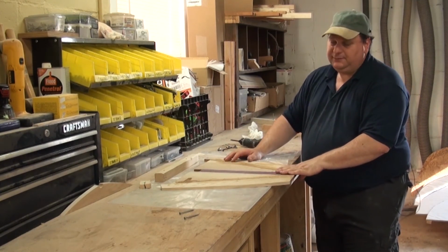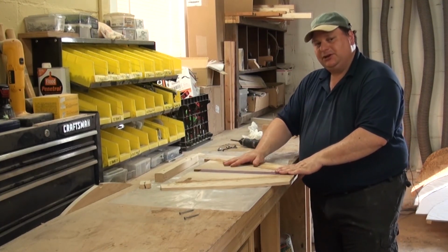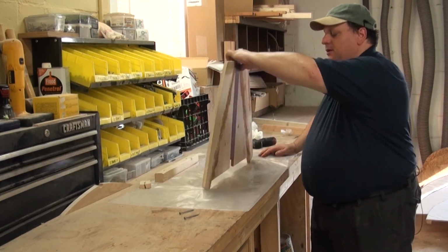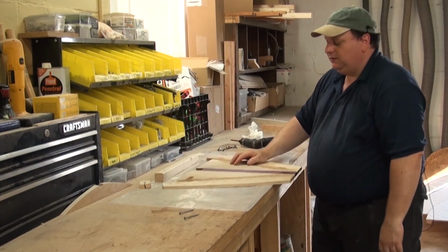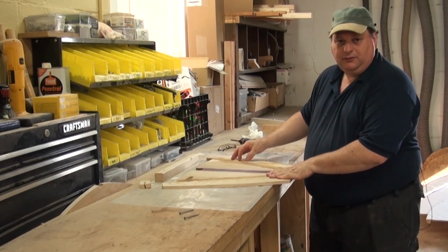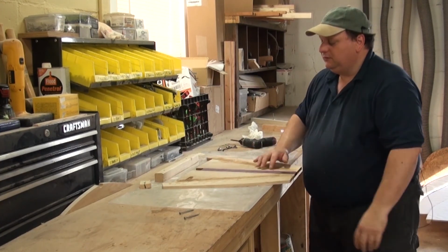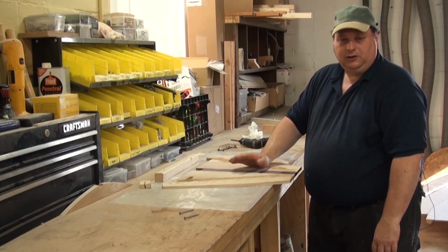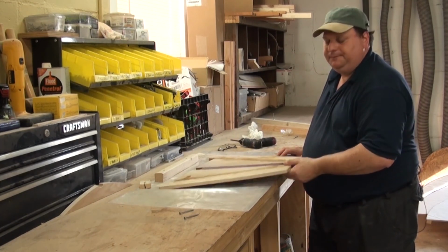And again, as you're gluing, I keep telling you, with epoxy, always, always, always, always clean up as you go, because you're going to be much happier in the long run that way. A lot easier to clean it up when it's wet than to sand it up. All right, so I am going to, in fact, sand this up. And then what I've decided that I'm going to do, I think it's going to be plenty strong because I'm going to have struts going across here before it goes into the boat on the underside. But I think what I will do is, after I make my cuts here, I will put fiberglass cloth along the bottom of it, just to give it a little bit of extra strength.